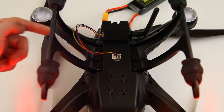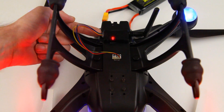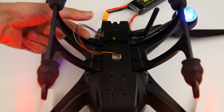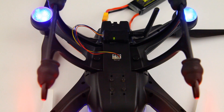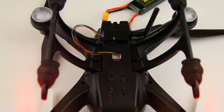An important tip: I've hot glued the connector to the module itself, because in my case the connector wasn't very secure. You won't be needing this cable for anything else, so you can just hot glue it down to the module. You can also tidy the cable with a zip tie.